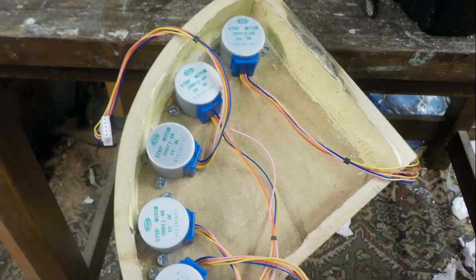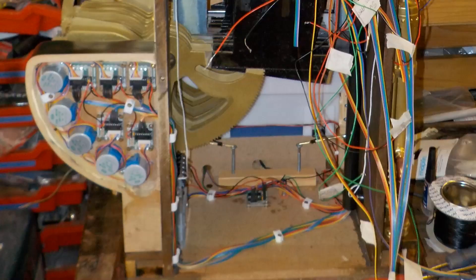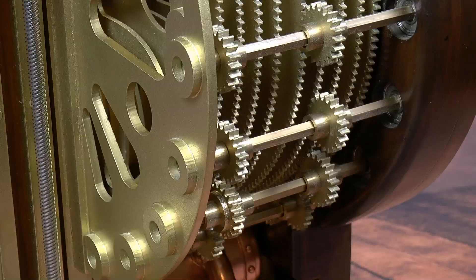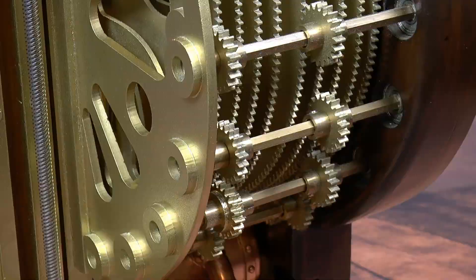You can see how they work. A small stepper motor at the back — five stepper motors in all — with a gear that engages the two parts of that particular scene, and then each one is brought into view. Inside there's a limit switch so that the Arduino knows when to stop them and how many steps to take to actually bring them into view. That was very exciting and I just love the look of it — it looks fascinating, which I was really pleased with.